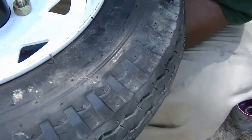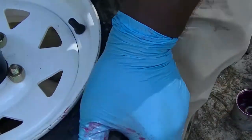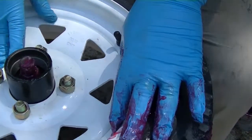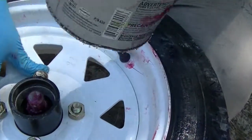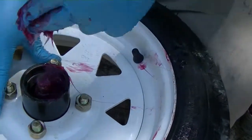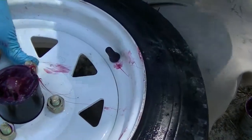So once you get it lined up, try to get a little grease in there, not to break the wheel bearing that's down in there. And then kind of stand up and push it down, and when you hear it lock, that means you got the wheel bearing all the way down, the hub all the way down. And then from there, you get with this little grease gun here that I hate. I've hated that since I was a kid, messing with this grease. But you put it in here, and then you got a grease fitting that you can put more in later on the back of this thing. But I mean, how far are you gonna drive with this in New Jersey? Just put some in here.